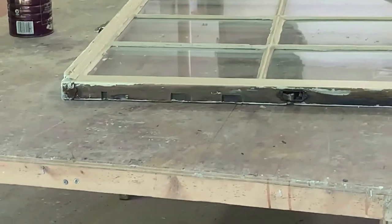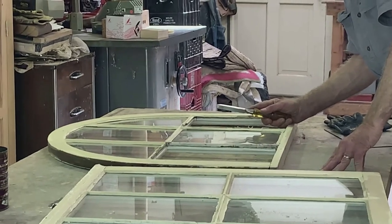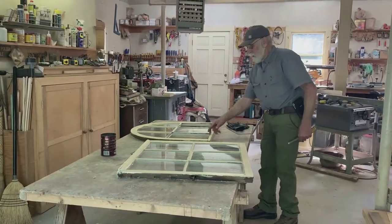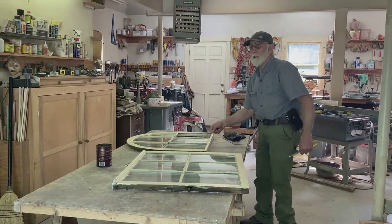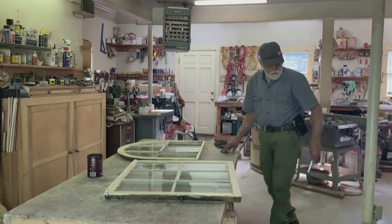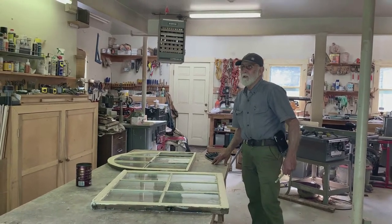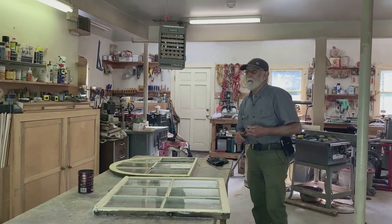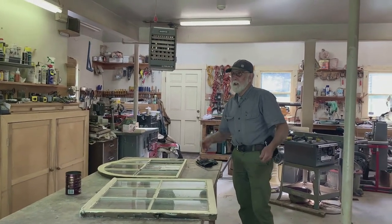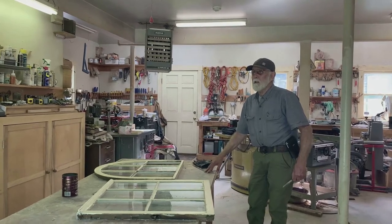So maybe looking at 190-year-old windows? They're in pretty good shape for that. The wood is amazing — that's what I said about the windows. I think most of it is cypress. Cedar's too soft; pine and fir I don't believe would last. Cypress grows in the swamp so it's resistant to moisture. That's like cedar — cedar was better than pine and stuff.